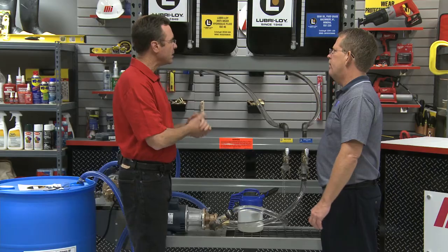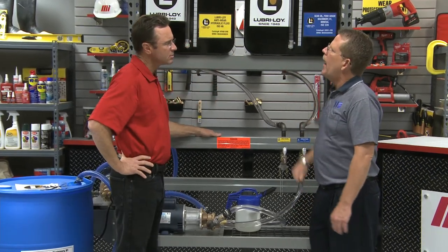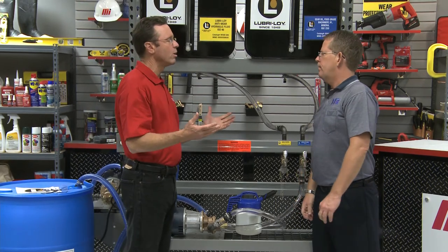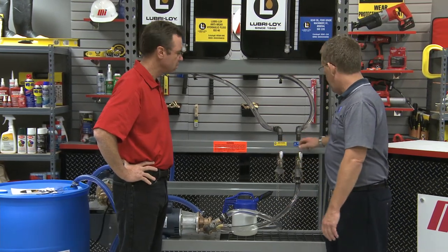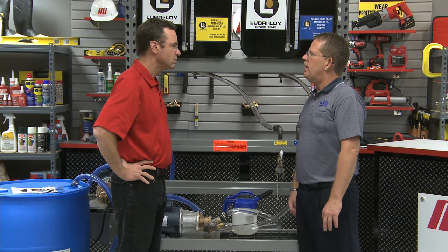I notice we have a separate pump here — and that's a simple change. What we have there is a food-grade and a non-food-grade transfer unit. We want no cross-contamination, so we added two transfer units. How long does it actually take to put together a unit like this? This particular system took about an hour-and-a-half for two containers. If you have an eight-container unit, you're talking two guys about three to four hours to build it. Now, what is the flow rate when filling the console? Filling from the transfer unit, you fill about three to five gallons per minute depending on the viscosity of the oil. Dispensing out of the valve arrangement, you're talking maybe two gallons per minute, again depending on viscosity.